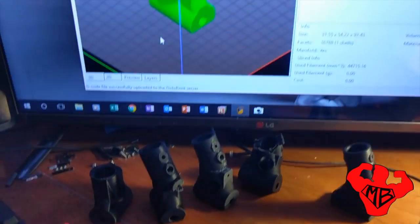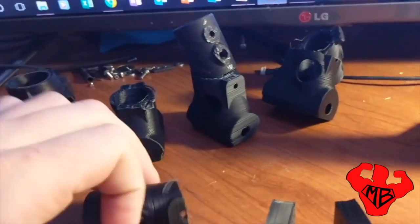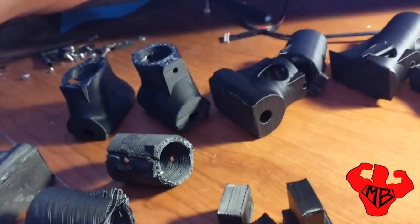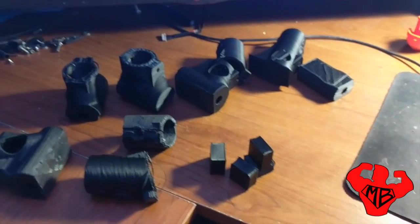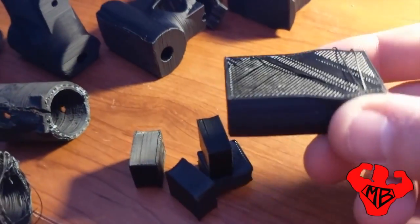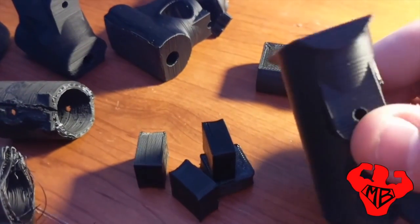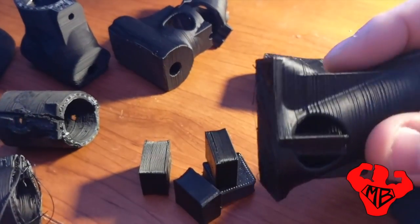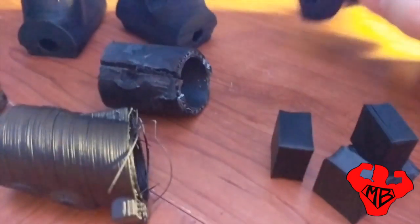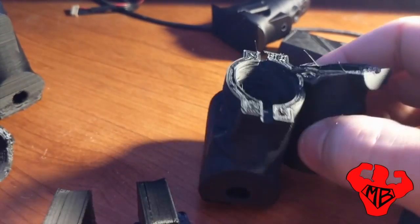Another important thing when doing an ABS print is the structure of the print. All of these have failed in one way or another. I started out printing at too low a temperature, and then went up in temperature but was still having rigidity issues. You can see on this one how it literally separated from a solid point — it just split apart. That was one of the first ones printed at 235, just too low a temperature for the plastic and also too fast. You can see the ringing; it just doesn't look like a very good part. I brought the next one up to 240, and once again it just split apart when put under stress.